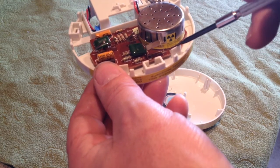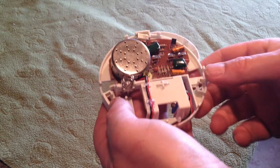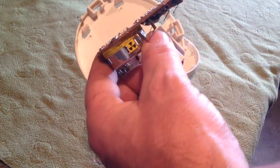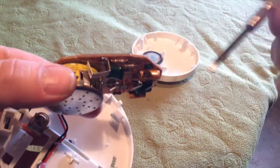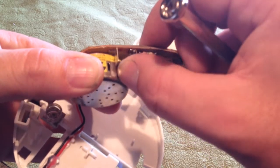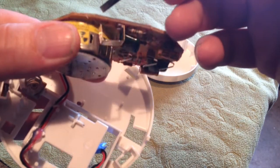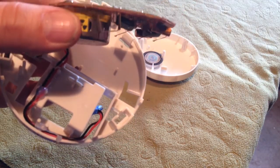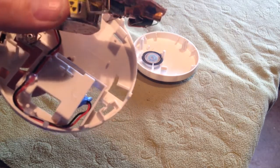What we want to do is take this board off so we can inspect underneath and see if we can solder the wire there, which would probably be the easiest point if you've got the tools. I've gone ahead and separated the PCB board from the housing of the smoke alarm. The solder points you want to pinpoint are: one on the switch — when you push the test button it creates the circuit and makes it go off — and one on another point away from that one. You'd want about 8 to 10 cm of wire in length and solder them on there.